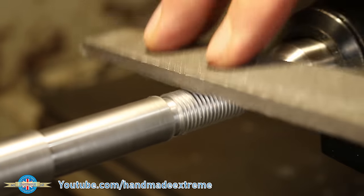There we go — finished thread. Let's give that a little test with a nut — that feels nice. There are a couple of ways to do screw cutting on the lathe: the beginner's way where you drive it back and forwards, which takes forever but is a good place to start; this intermediate level method; and the more advanced method where you rotate the tool post, which is better for tool load but carries more risk. For small threads as a hobbyist, I think this intermediate method is a good way of doing it.